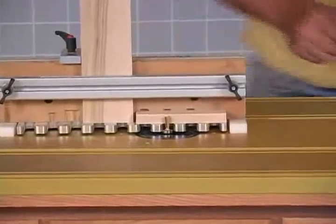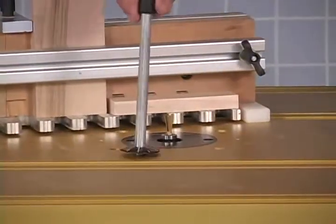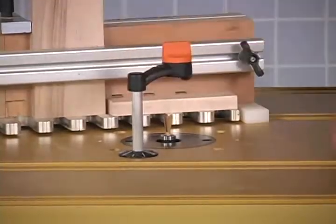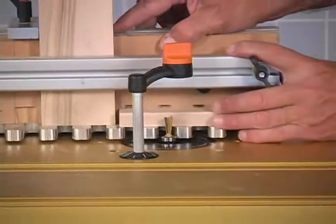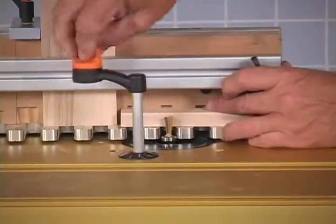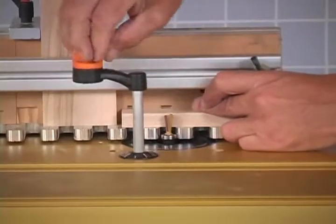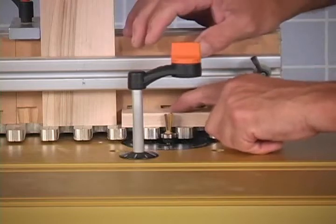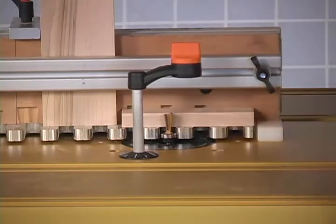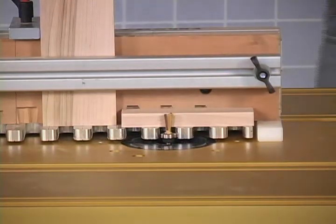That way when my dovetails go together, they're going to extend just a little bit and I can sand them off. Okay, so what we're using now is a 2 1/4 horse router. And this has that router raiser built into it. Remember like I told you earlier? So we can raise this thing from the top of the table. We're going to crank this up and you can see that bit coming up, right? So she sticks just a little bit above my stock right there. Okay? I'll lock my router in position and we're ready to start cutting those dovetails.